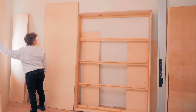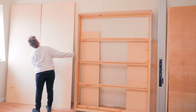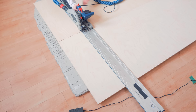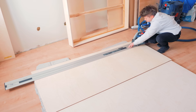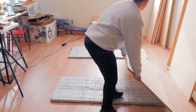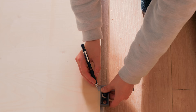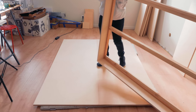As these came from different boards, the wood grain doesn't match perfectly, but I found that placing a different strip of material over the seam disguises that fact — and I will again make a colorful detail out of this. The bed frame needs to be attached to these boards with a quarter inch edge clearance on three sides to reduce the gap seen from the front when the bed is up on the wall.